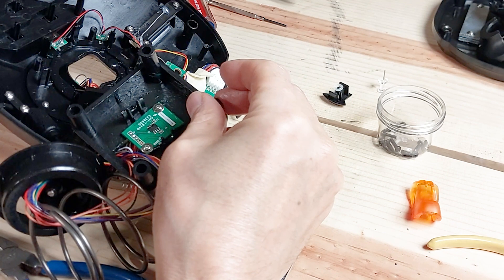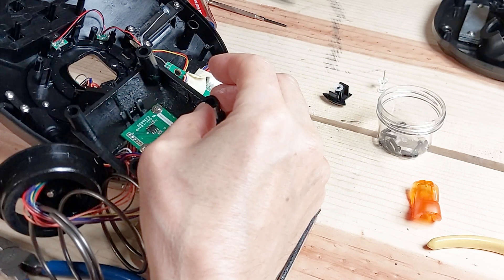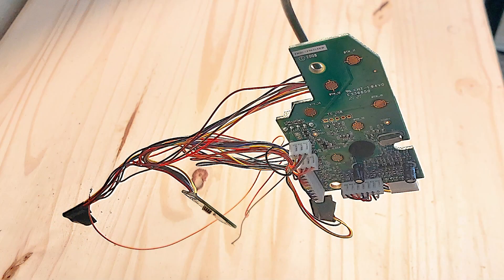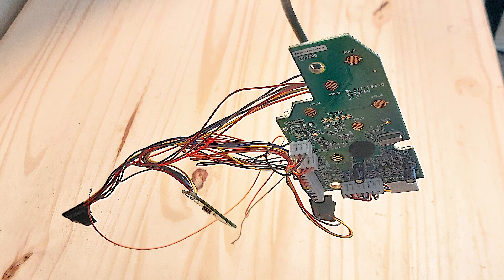Because of the way the joystick was assembled, it's actually impossible to remove the whole thing intact without cutting wires. That's because what appear to be connectors are actually soldered directly to the circuit boards, so we'll need to cut those wires. And if you cut them in the right place, this is what we'll be left with: the main circuit board, the little Hall effect sensor board, and a bunch of long wires that we'll use to connect to the throttle.